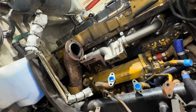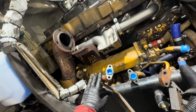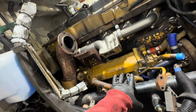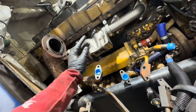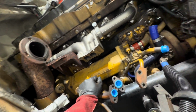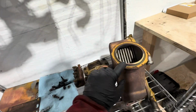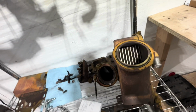This is actually a Saturday I came in. So Monday, I'm gonna go ahead and get all the other parts ordered. I need my 2 oil drains, my 2 oil feed gaskets. I did not even get my turbo to manifold flange gasket. And then there's a pre-cooler as well. This O-ring is flat. I'm not gonna rerun that. Just asking for a leak, so I'm gonna order one of those.